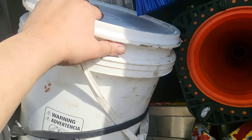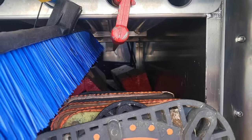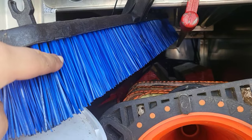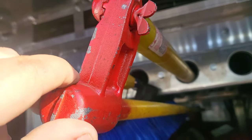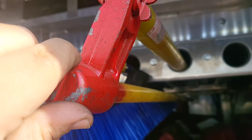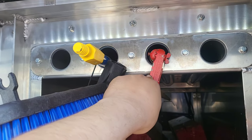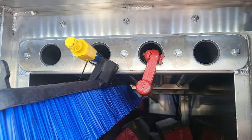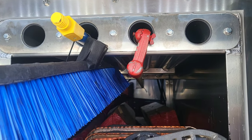Always keep speedy dry in case there's an oil spill. Traffic cones, plenty of wood, a shovel, a broom to clean up, and a height stick so we always know how tall the load is or the truck that I'm towing - because it can't be above 13.6 feet without a permit. You don't want to hit bridges or power lines, so it's always a good idea to know how high the truck is that you're towing.